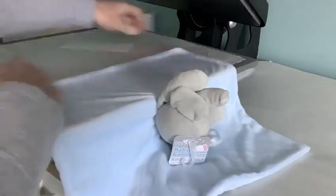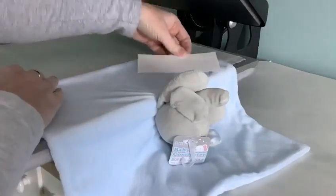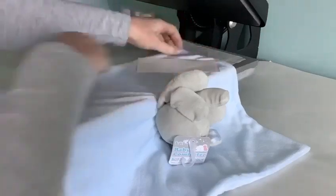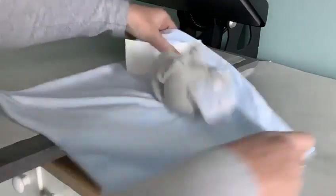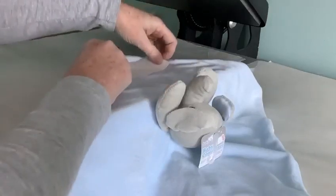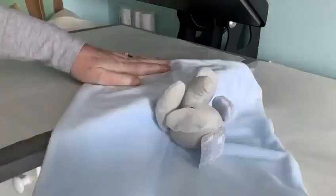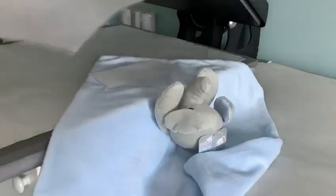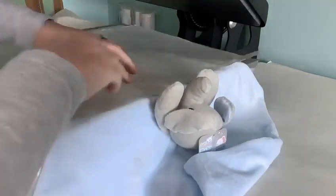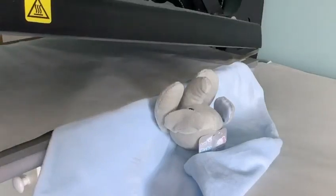You can't get the elephant or the toy in the press, so I'm just going to lay that over in the corner and get it in as far as I can so you've got quite a good area that you can press on. Remember your blowout paper. Very light pressure — I've got it on 190 degrees for 60 seconds.